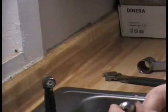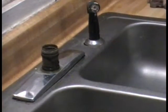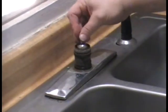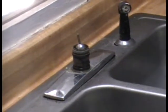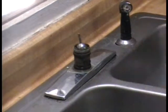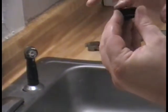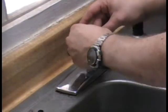That's some interesting geometry — which is partly why single-handle faucets can be tricky; you have to get it just right to get the right amount of hot and cold, as opposed to turning two separate handles. But for a kitchen faucet you're usually using hot water anyway. A little more grease on that, and a little on the cap too just to help it seat and move more freely.